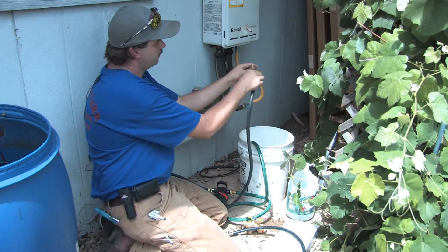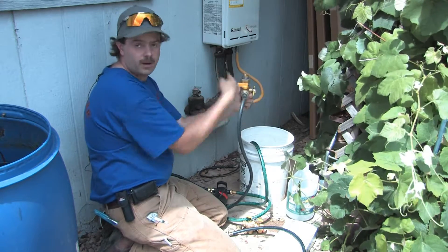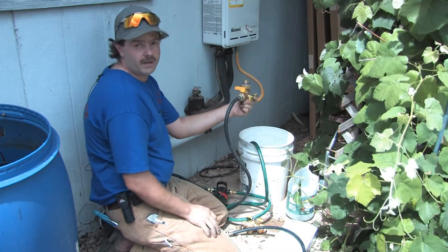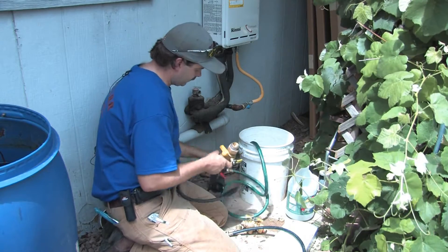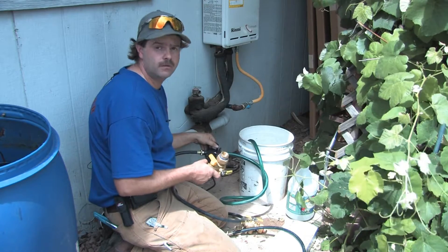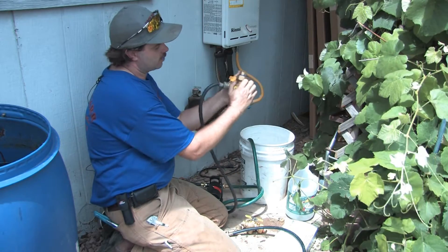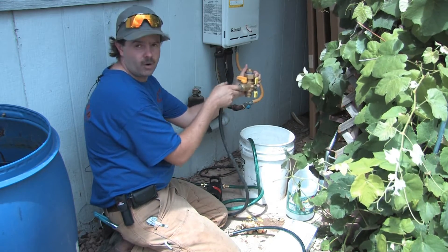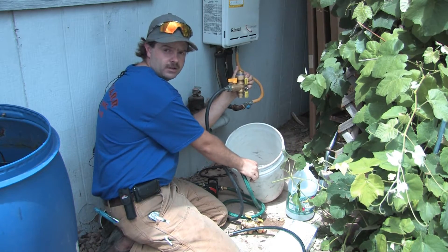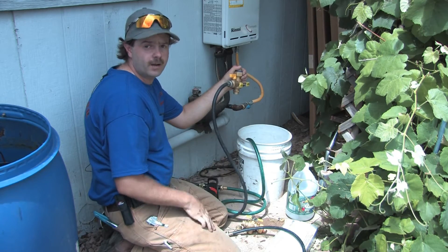Also, this valve here can close and open. With this valve closed, you're not going to pump anything through — it completely isolates what you're doing. No water can come in or out of the system. A lot of these pumps need to be primed, which means they need to have water put into them before you turn them on. So what you have to do is leave this cracked wide open and run some water back in until you see water bubbling out into your barrel. Once you see that, go ahead and shut the water off — then it's ready and primed to pump.